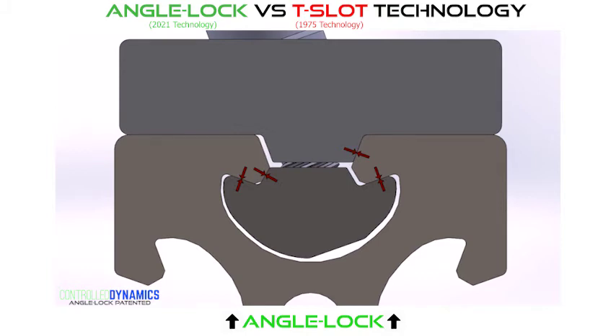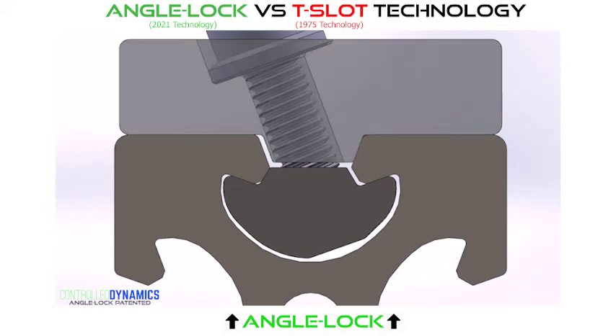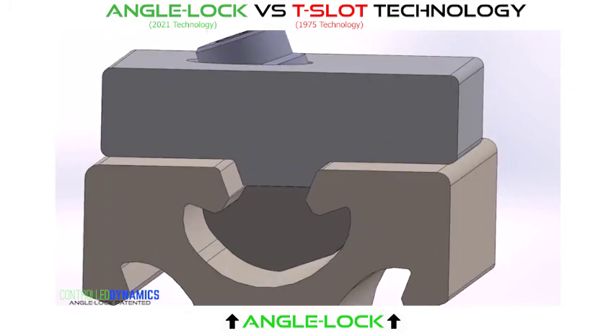And as the fastener is brought up to its required torque, the appropriately sized bolt stretches slightly. Friction is created in a fifth plane between the bracket and profile, and the entire assembly is pulled together to form the mechanical lock. Even when subjected to a large direct external force that attempts to separate the two attached components, the stretched bolt acts like a spring and keeps the assembly in precise alignment. And try that with existing aluminum framing systems.